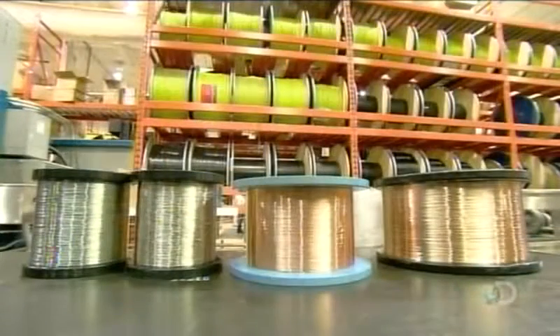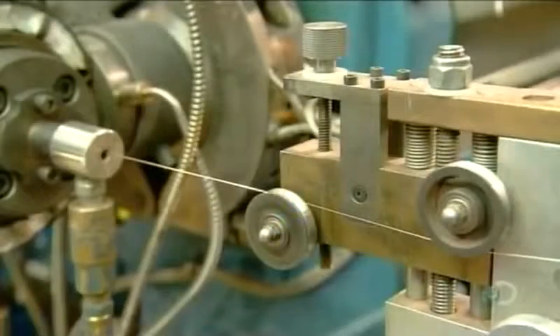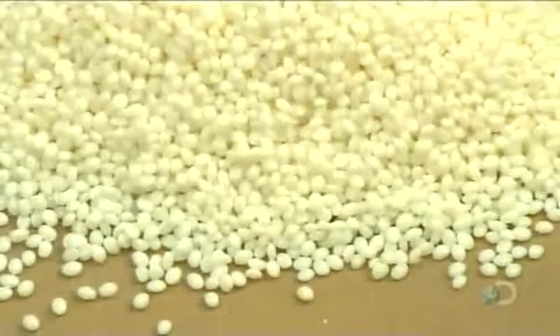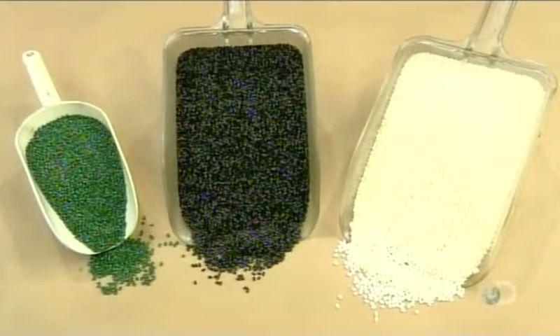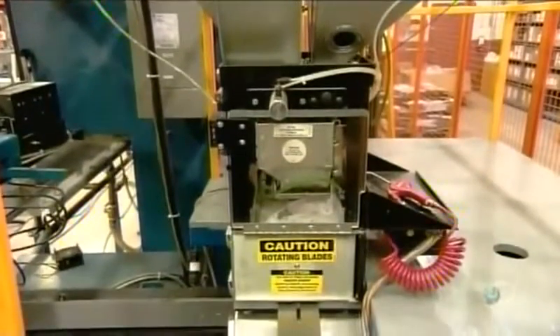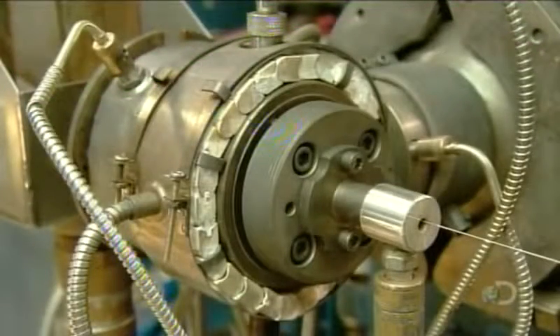At the core of those electrical heating cables are copper or copper alloy wires, called conductors. An unwinding system feeds each spool of conductor to an extrusion machine. Extrusion machines force molten plastic through a die to form a particular shape. Raw plastic pellets are loaded into a receptacle called a hopper at the top of the machine. The pellets drop into a heating device which quickly liquefies them, and the machine forces the molten plastic through a round die, forming a plastic jacket around the conductor passing through. This jacket insulates the bare wire.